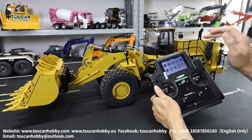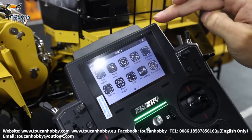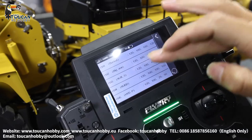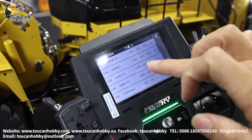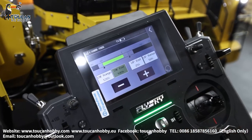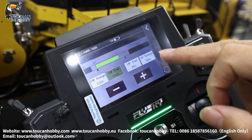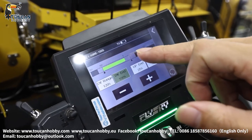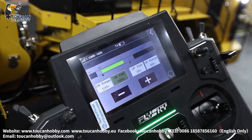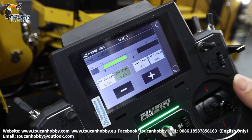Let's first go to the radio basic. Let's see the setting of the pump — channel root. Pump is channel 5. Click channel 5. So now upper end it is 25 percent, upper range 50 percent. That means the maximum 50 percent from the right side for the pump to start. But as you see, the pump stops at the left side — 100 percent, so negative 100 percent.